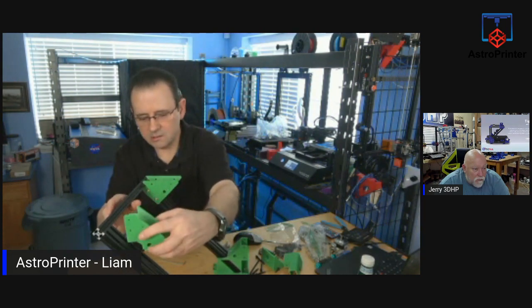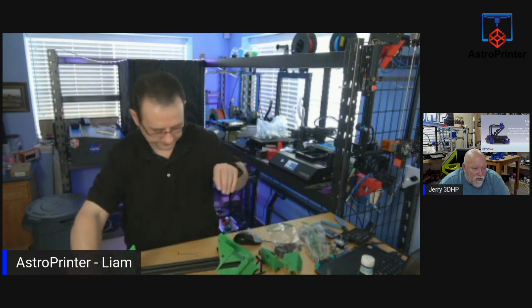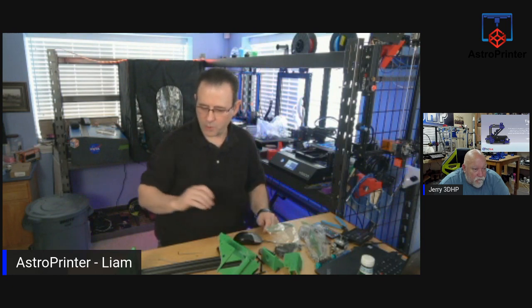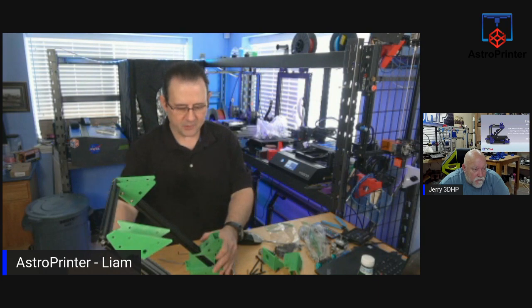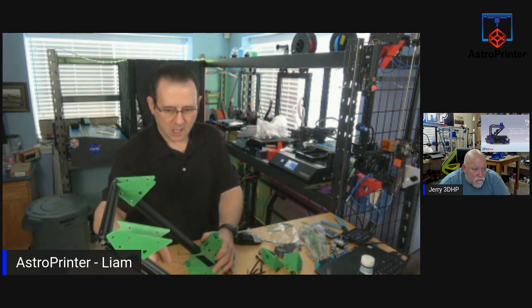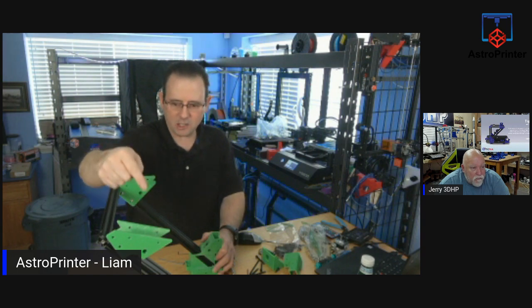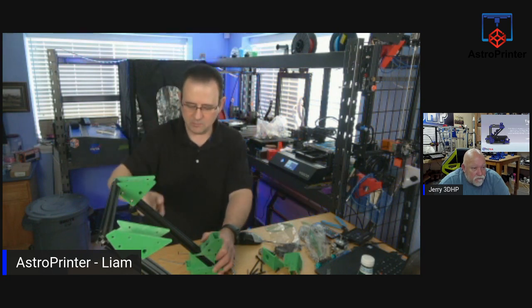And attaching this way. Aren't those both mirrored parts? No, they're not. They're different. Because the way they're doing it is, one side will have the stepper driver on top, and that will have a small belt coming out of that to a gear, to an idler, which is driving a shaft between these to move both, because there's a belt on both sides, to move the belt up evenly on both sides.